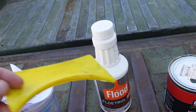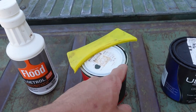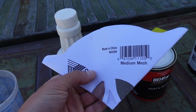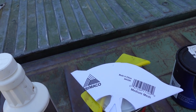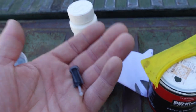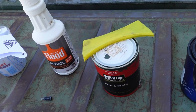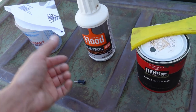You'll also want these cheap little disposable plastic pouring spouts — they wrap around the can so you can pour without getting paint in the ridge, saving a tremendous amount of paint. You'll need strainers, usually a four or five pack; I use the mediums. They filter out large chunks that would otherwise plug up your spray gun. This goes in your paint cup on your HVLP gun. My process: I fold the strainer over my cup, shake up the paint, put my pour spout on, add my Floetrol first so I know exactly how much I have, then pour my paint in, then add just a splash of water.